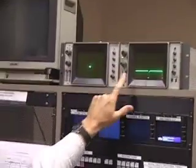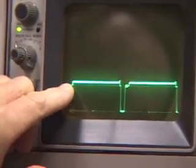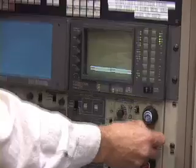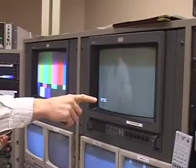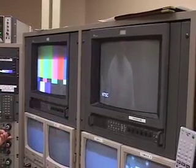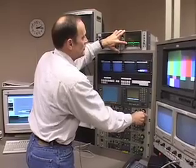We'll go up to this unit here — this is the analog. I'm on camera number one. This right here is where video is, and I want that line — I'm adjusting the master pedestal on the CCU, that's this lower knob. I'm going to adjust the master pedestal; you can see how it's going up and down. If your master pedestal is above 7.5, your blacks will look all washed out. And if it's too low, it'll look crushed. So back here to the waveform monitor: iris closed all the way, and I adjust my master pedestal to 7.5.